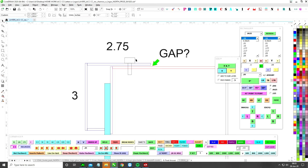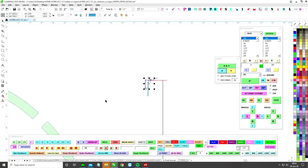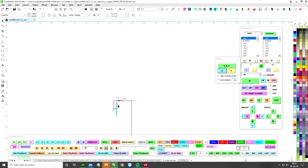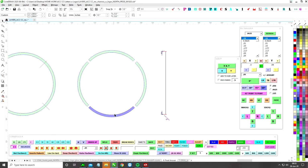Just don't want to run into I-10 Auto Body where all the retainers were a little too big. I think we went an eighth on that, and it kind of turned into a little bit of a debacle. So keep in mind that these will shrink a little bit. So if we do a 16th, we might lose some of that when we go to weld it together, especially on both sides here. And then also, I'm going to break it into the 4 sets.